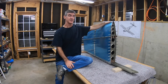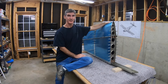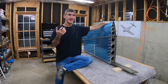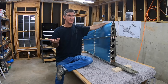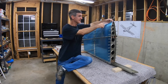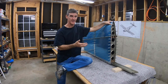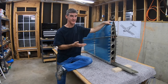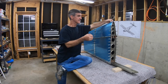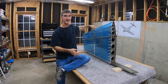That was a lot easier than I was afraid it was going to be. Everything went back together pretty smoothly. After the first time I put the skin on the skeleton, it was a real struggle — very tight. Same thing I've seen happens to everybody. It's just really tight, really hard to get it bent around and get the clekos in. I'm sure because it had already been together once and was match drilled, that's why it was easier this time. But also, as I mentioned, after I got it apart from last time I had come back and done some more shaping on these nose rib flanges, each of these points, and I'm sure that helped too.